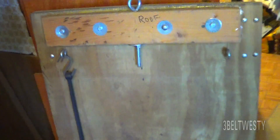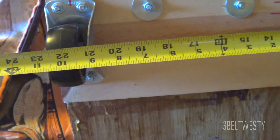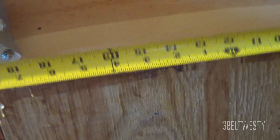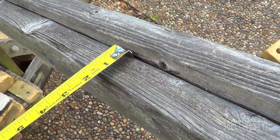It's kind of total overkill — this thing doesn't really deflect much. For two bundles you could probably get by with something smaller, but I want to keep this in the garage in case there's another hurricane. I can throw together a track from two-by-fours, two-by-sixes, or two-by-eights — whatever materials you've got. On the outside of the track you've got about 23 inches, and on the inside it's roughly 20. I used three-inch wheels because that's what they had at Home Depot — also a bit less rolling resistance. I built it treated so it won't get torn up if it gets rained on, down here in the deep south.